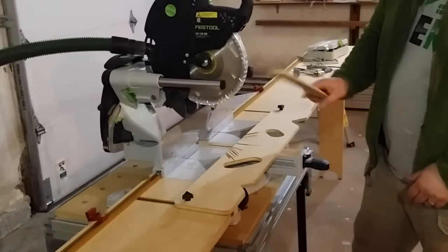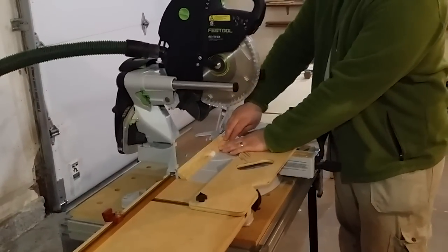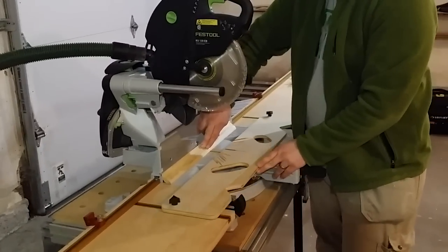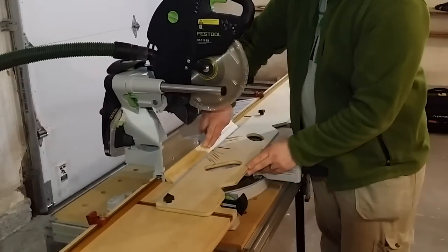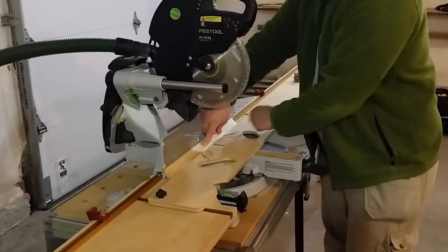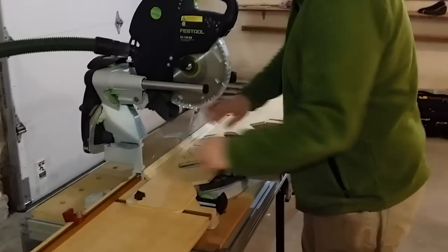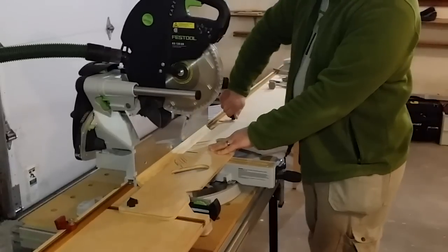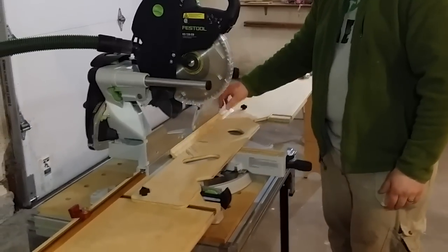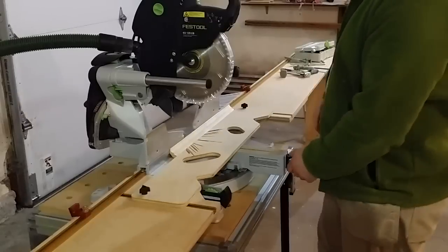Pretty few small pieces of crown, that's what we were using today. What this does is it allows you to make a repeatable cut. You'd calculate or figure out the distance in that crown, the projection on the ceiling. And since you cut a crown upside down, you measure off the fence to the face of this, bring it right up tight, or wherever those marks are, to be a little more precise, and you screw it down. Now, when you're coming in to cut a piece of crown, simply drop that in, and when it falls, everything's at a repeatable angle every time you cut it.